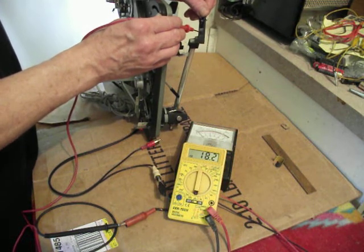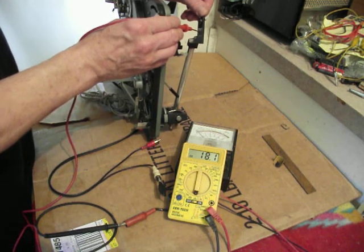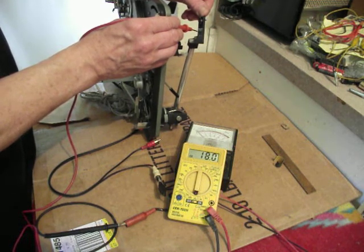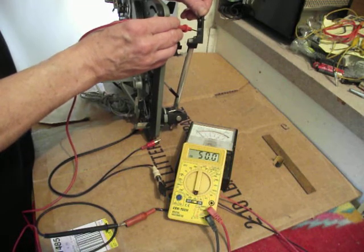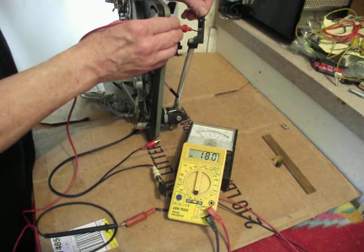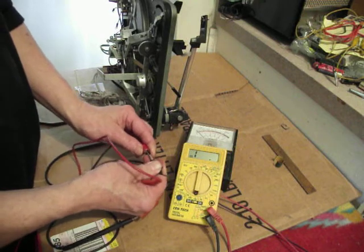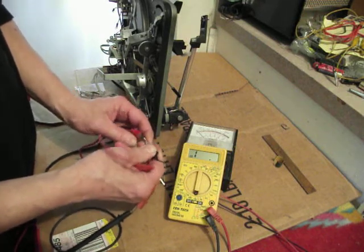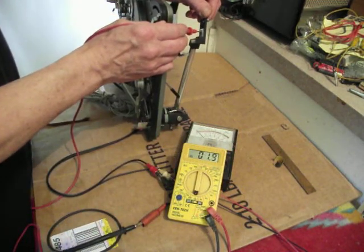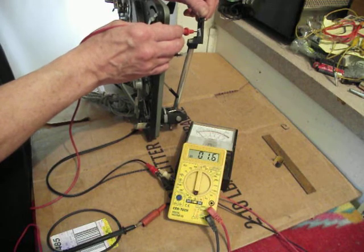This is the one I was having problems with. Over time the copper wire can break down and develop resistance from oxidation, and also cold solder joints. I'm getting erratic resistance — right now it's at 18 ohms. You don't want it that high; you want it around one or two like I'm getting with the other ones. One side was 18, now I'll go to the center of the other side — color-coded red — and I'm getting about 1.6 to 1.7, fluctuating but under two, which is acceptable.